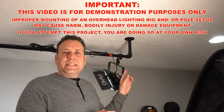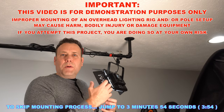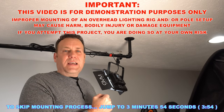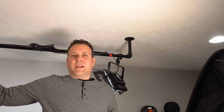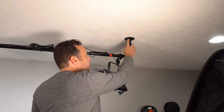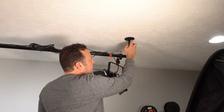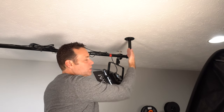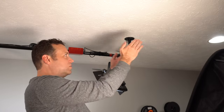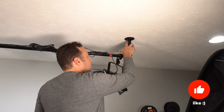Now I'm going to go over how to properly mount our ceiling-mounted pole system. The first thing we need to do is be sure that all the fittings on our pipe are really snugged down and tight. This upright should be 100% parallel to the rod on the other side — we don't want it canted. The flange mount needs to be lined up as well. There are four holes, and you want one set of holes running straight along the pipe and the other set running perpendicular, so that whether you're going into studs or joists you can anchor in either direction.